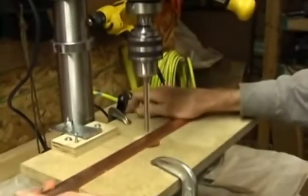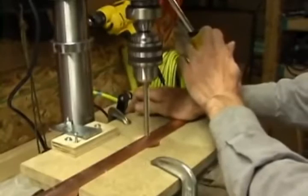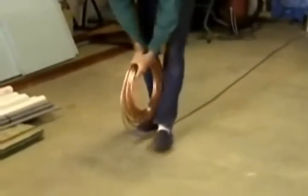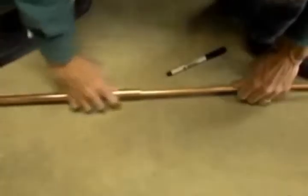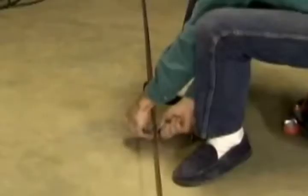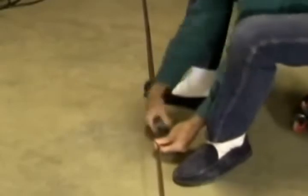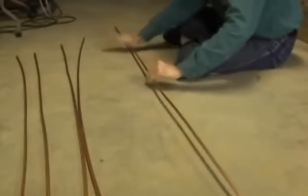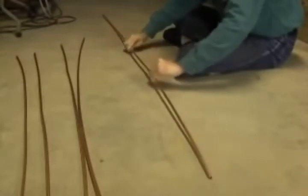My small copper tube has a 3/8-inch outside diameter and a 1/4-inch inside diameter. It is carefully unrolled on the floor to prevent kinks. I use 60-foot rolls because it divides perfectly by 90 inches. The larger diameter tool allows the smaller copper tube to be marked and cut at exactly 90-inch pieces. The copper pieces still have bows in them, so carefully bend the copper tube as straight as possible. I have found that smacking it against a flat surface does a nice job.